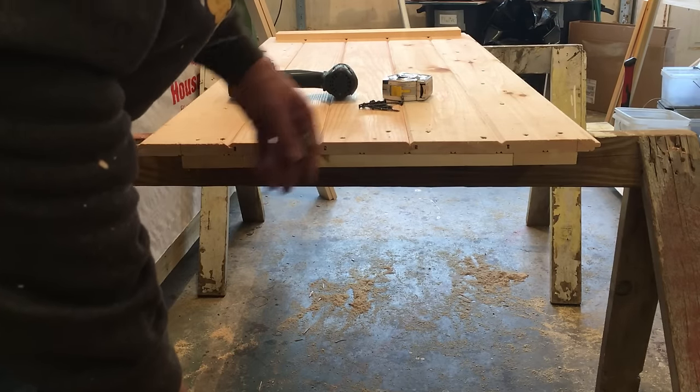On the bottom section of the door, on the top there'll be a shelf — a 1x4 — and you can see I already notched out this one. I just have to do that on this side, and we'll glue and nail that down. There'll be a slight space, just under a quarter of an inch. The trim on the door opening sticks in half an inch, so I came in three quarters of an inch and I'm going to make that straight across. I just used a bottle cap to give me a round circle on this side. I'll hand sand that, smooth it up, and paint it.